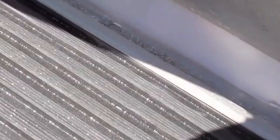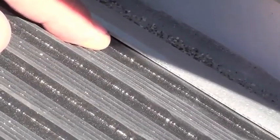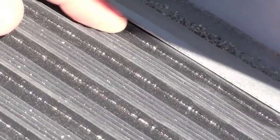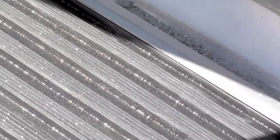Okay. Just tuck that piece in there as far as you can. Any kind of large gap or opening will create a riffle behind it, and it will actually suck gold back in behind there. Look at that, there's a piece of gold right there that was left from the last guy that was operating this. Okay, let's put the second mat in.